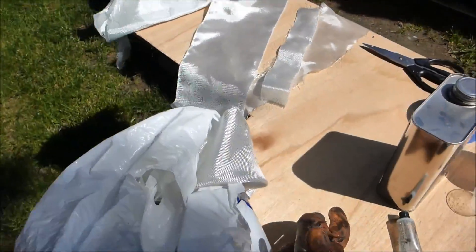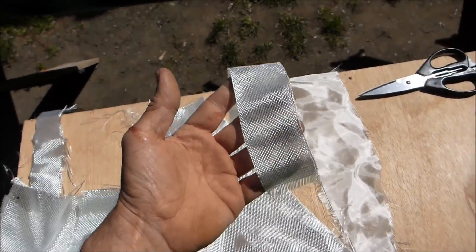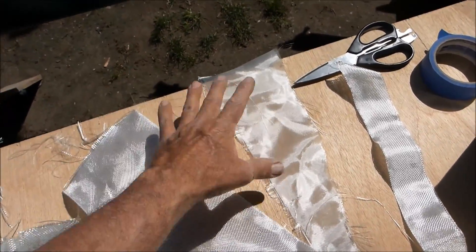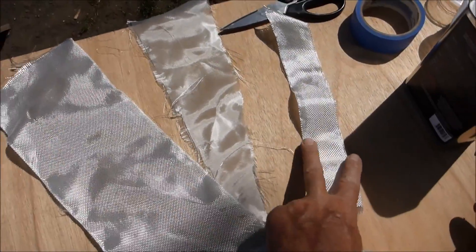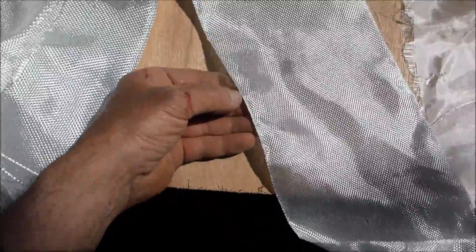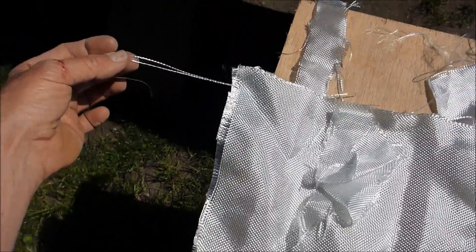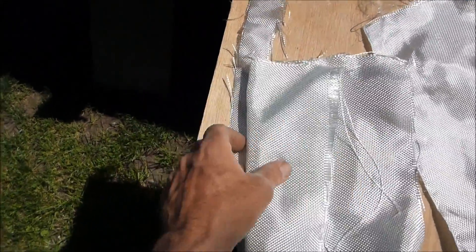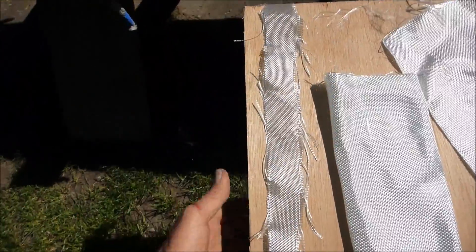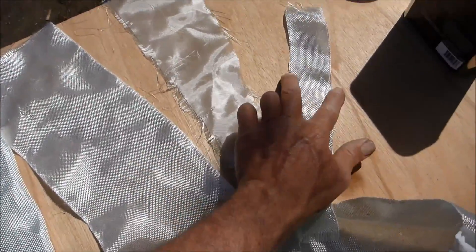You want some fiberglass cloth. The most useful is two-inch wide, eight-ounce tape — eight-ounce refers to the weight of the material, a pretty medium grade. This thin silky stuff is 1.5 ounce, which I use for top finishing. This wider cloth is about six inches wide and heavier, around 20 ounce — the edges fray, which can be useful for strand work but not great for repair. If you cut eight-ounce cloth into tape yourself, you get shredded edges, so it's easier to buy the tape — a little more expensive but has nice sewn seams.